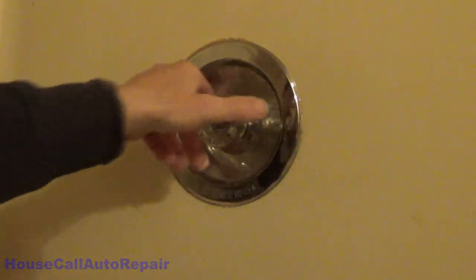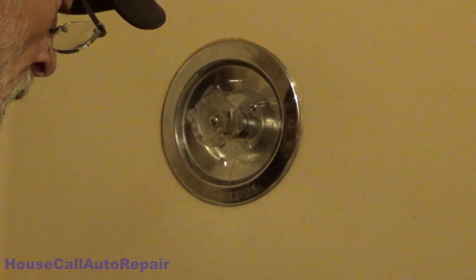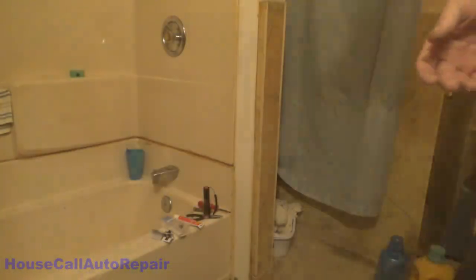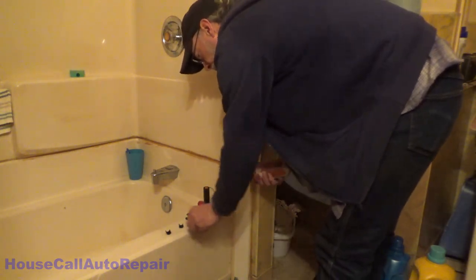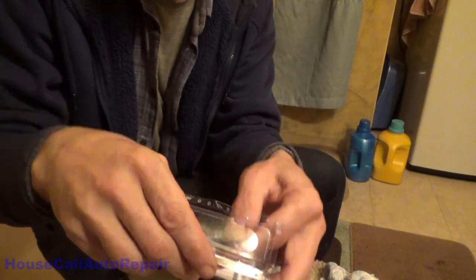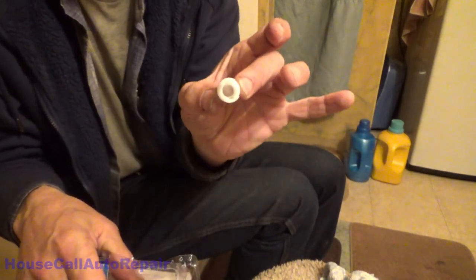Before we put the little cover back on, let's make sure cold is on this side and hot is on that side. Test the water — cold on cold, hot on hot — then shut it back off nice and easy. Cover back on and verify we don't have any more drips. Also, at the bottom of the package there's a little fitting made for rotating the valve that I didn't realize was in there — this piece slides on and lets you rotate the valve to line it up to put the horseshoe clip back in. Double check your contents before you throw stuff out.